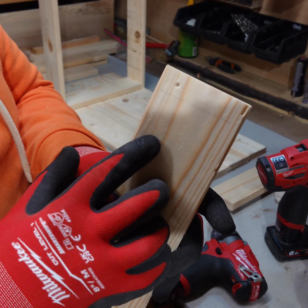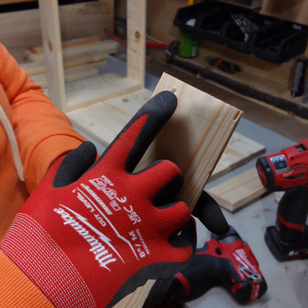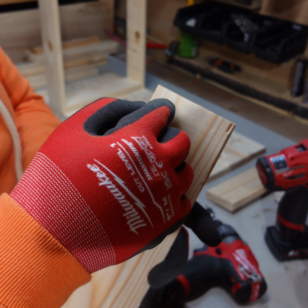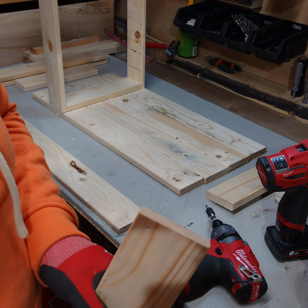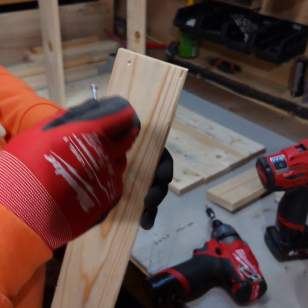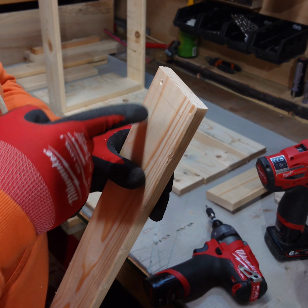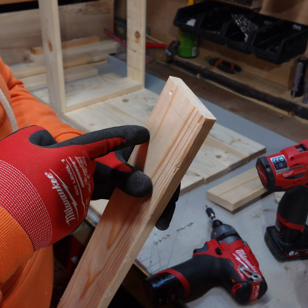You see, you need to make it acceptable to sink the screw in it, because the head of the screw, when it goes in the wood and it is pallet, you will just crack it in half, because pallet wood is always very dry, too dry, that it can be cracked very easily.